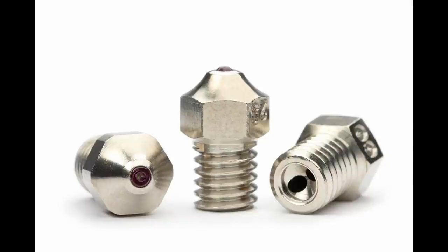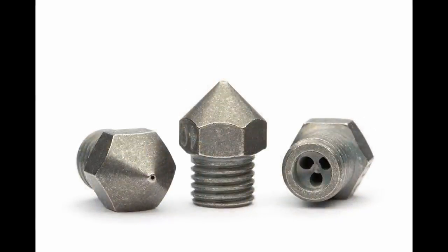So anyway, this new idea, well, we can't say it's a new idea, because 3D Solex, a company making nozzles, they make 3D stuff as well, but they have these nozzles with a filament splitter, and they've had that idea for quite a while now. They also had one version of their nozzles with a three-way splitter. Unfortunately, it was just available for Ultimaker's printers. They have ones that are compatible with V6 and RepRap and all kinds of other compatibility, but they were only a two-way filament splitter.